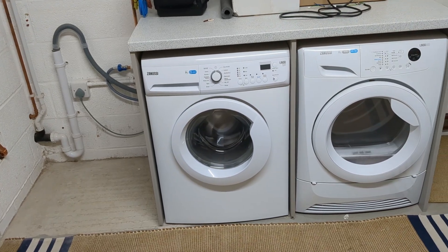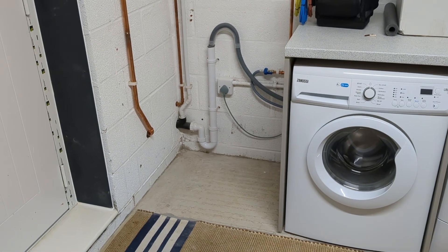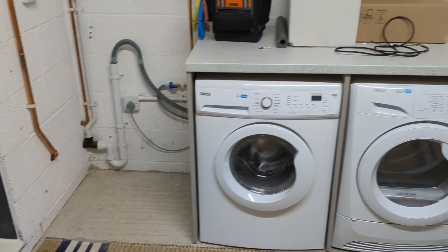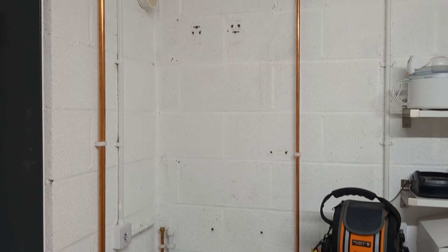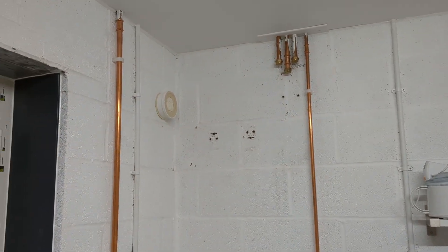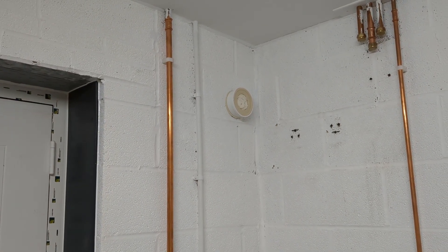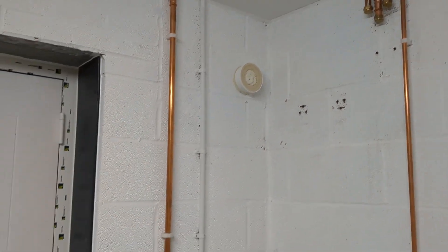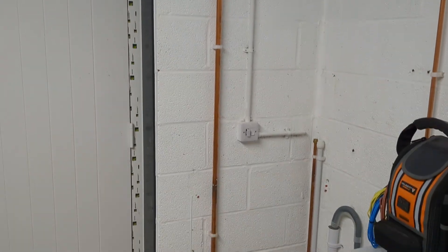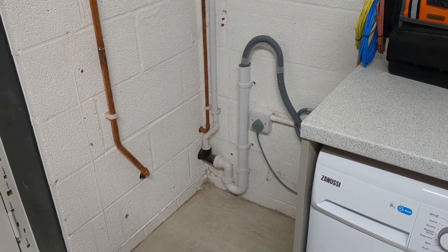These vents are going to be taking the inlet and outlet air so that it doesn't come from the garage, which hopefully will prevent the garage getting too cold, and it will ultimately get installed in this little spot here. This is the washing machine and tumble dryer — this actually used to be over in this corner but my dad and I shifted the whole lot over so that there was space for the IHP cylinder, which will go in where the old boiler used to be. The boiler used to be installed up there with a vent going out there for the flue, and I've removed that and bunged it up temporarily until the vent can be extended and reused.